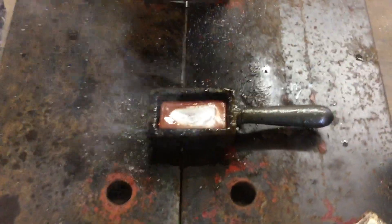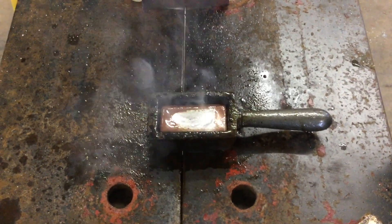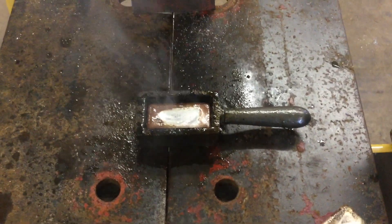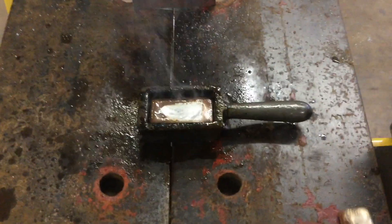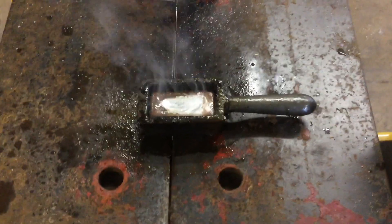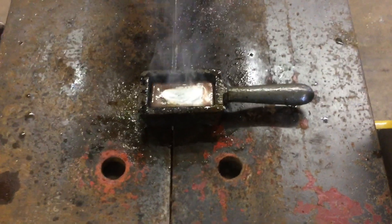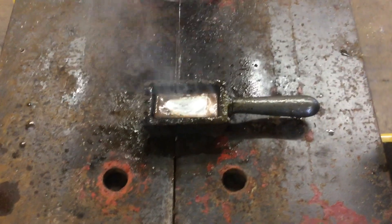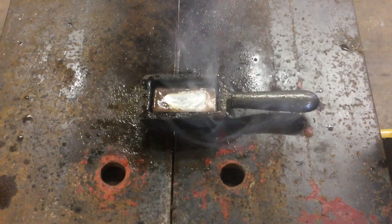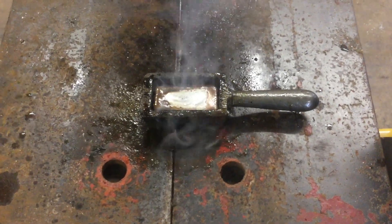Cook all that up — this is a 10 ounce bar of fine silver. It's cooking oil that prevents it from sticking and from causing the mold to have thermal shock, which could cause it to crack or even explode in some cases. We've been using this mold for several pours now, so the mold is hot and it is smoking hot.